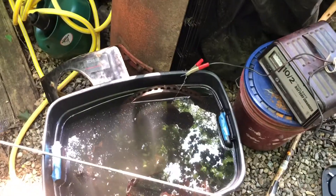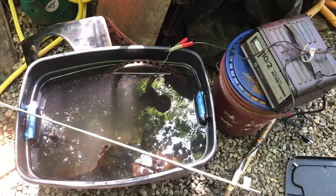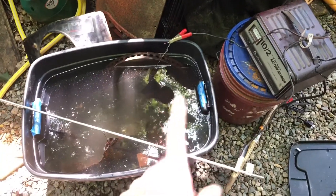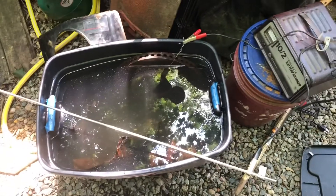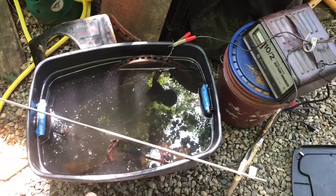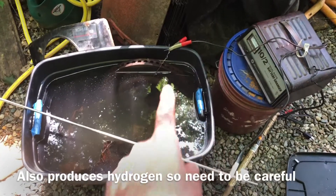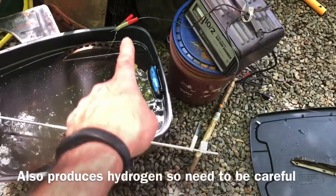I'll probably run it at two amps, maybe 10 amps in the beginning. I also put the soda wash in — it's basically half a cup for every five gallons. I have roughly 15 gallons, so I put in about one and a half cups. The more you put in, the faster it goes. You have to be careful because you're dealing with electricity, and you can't use certain metals because the resulting soup will be poisonous — you can't just dump it on the ground. Don't use stainless steel. I'll go plug this in and get it started.